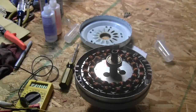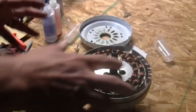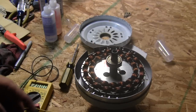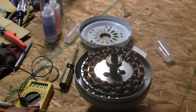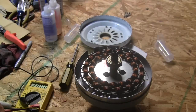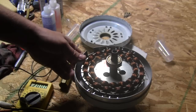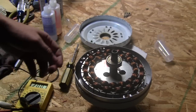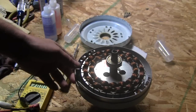Amps are pretty low — I think it's only a one-amp rating on the wire that's in here. Essentially it's creating an electromagnetic field that's outputting to these two wires here. In the end you'll hook it up to a bridge rectifier — you can buy those at Radio Shack for maybe five bucks — and it converts it to DC so you can hook it up to your batteries and use this thing for some meaningful power.